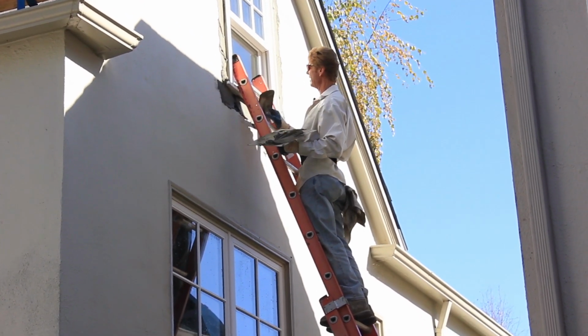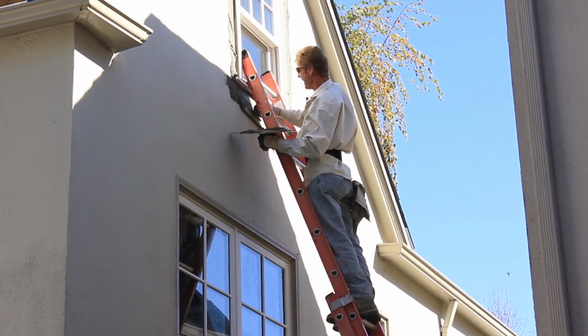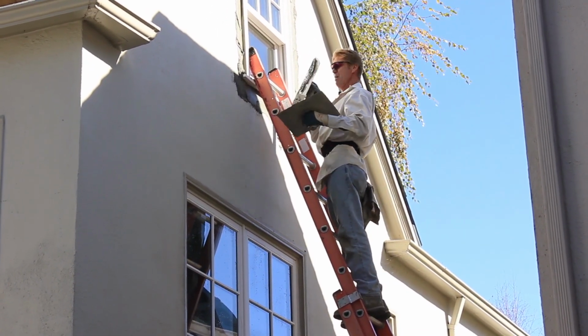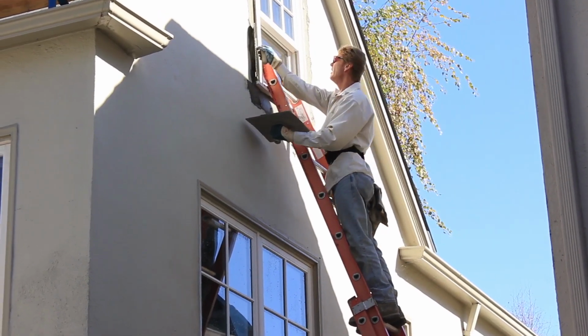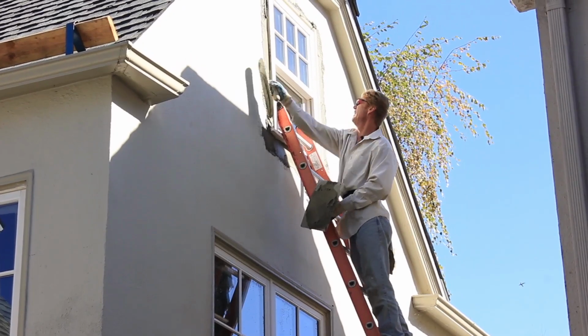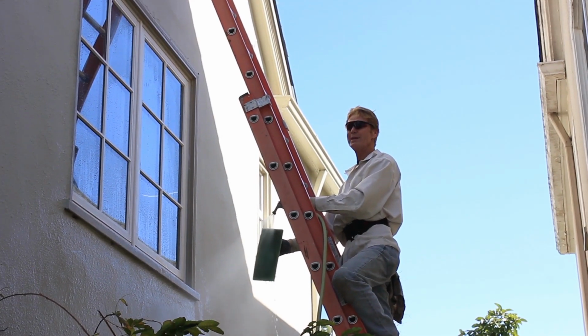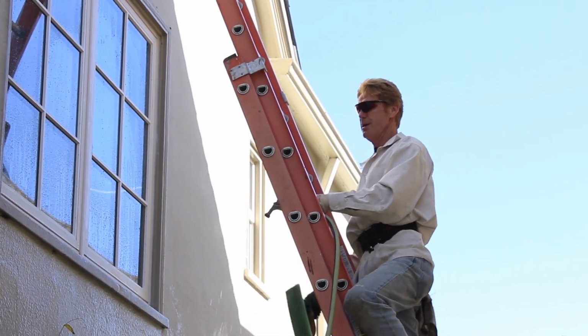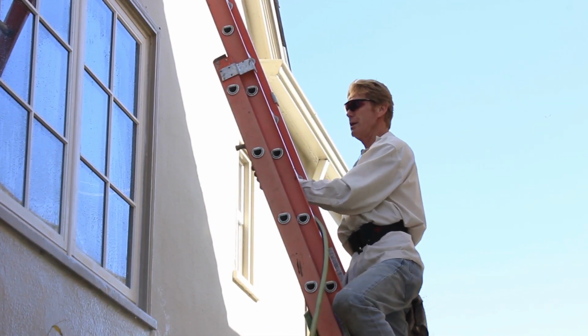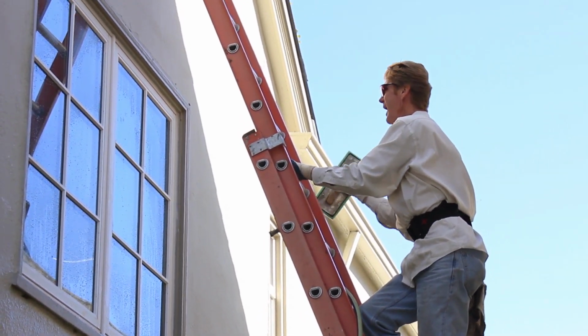And last piece I got to do is over here. Get in there, guy. Beautiful, beautiful. Okay, now give me about 5 minutes for this to set, and I'll float it. Show you guys a tip. I'm wetting this green float, or I could have just stuck it in a bottle or a bucket of water. Now I want a lot of the water out of here.